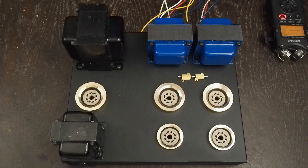Hey y'all, we're ready for the next episode in our 6SQ7 amplifier build. I said this time we're going to put the cathode bias resistors on the underside of the amplifier, but I just can't do it. That goes against my whole logic of putting something that runs that hot underneath the chassis with all those electrolytic capacitors and other devices that can be damaged by heat, given that there's really nothing else under there creating heat except for these resistors.